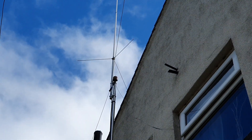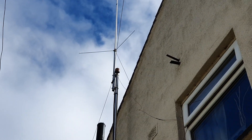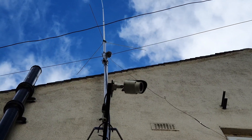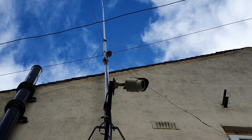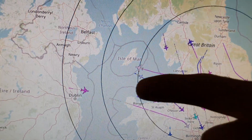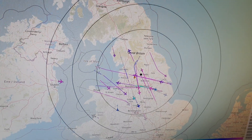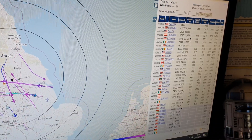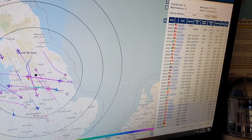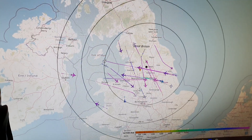I've now got that in position. That's up there. I'll be tidying the wires up a little bit later — it's just an experiment at the minute. We'll see whether or not that makes a big difference on the receive. It should do. We'll have a lot better 360-degree reception because the stone of the house will not be obstructing the small wavelengths on 1090 megahertz. The noticeable difference is immediate. I can see an aircraft leaving Dublin right over there — that was not in my footprint previously. So we've just extended it immediately by at least 50 miles, probably more. Things are looking amazing, and this is just within the first couple of minutes. Look at the amount of aircraft coming through — the list has doubled. We've now got 34 aircraft in position; I was usually receiving about 10. So we've gone from 10 to 34 within a couple of seconds just by raising the antenna outside.